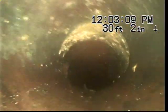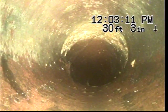It just seems like the pipe's starting to fail. That concrete is falling apart throughout this pipe. So I'm guessing there might be a concrete stretch that's falling apart in there that I can't see, or the clay has shifted and caused a major flat spot. But I would recommend getting that repaired.